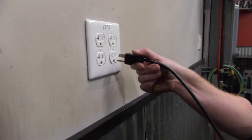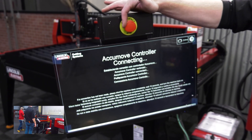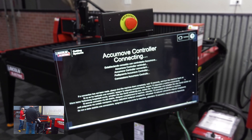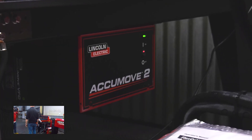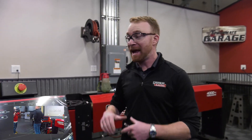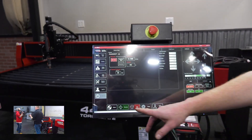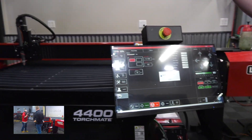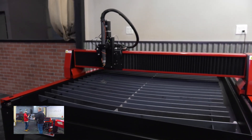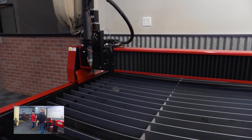At this point we can plug the machine in. Release the e-stop with a quarter turn to the right, and now your AccuMove box should be on and blinking. Now that your machine is plugged in, the controller is connected, and the machine itself is clear of any debris or tools, we can go ahead and press the datum button. Your machine will now move for the first time in your shop, finding the z-axis, x-axis, and zeroing out the gantry itself.